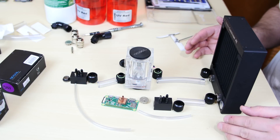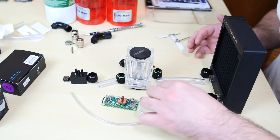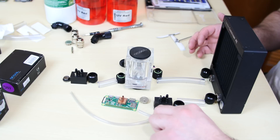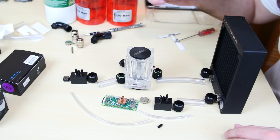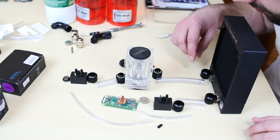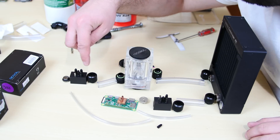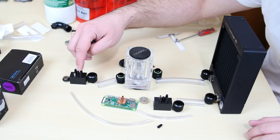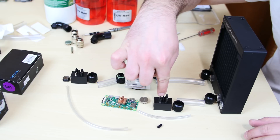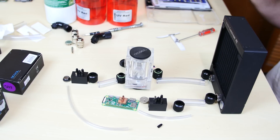I've placed out all the parts exactly the way I want this to run and cut all the tubes to my desired length. I forgot to show you guys one thing — this is a plug that goes on top of this splitter. I already put four of them there; it's a five-way splitter, and this splits the small cable into the big cable. I'll leave a link to this plug in the description. I put all the fittings and plugs where they belong and cut everything to length. Here's how the loop runs: out of the radiator, fitting into big tube, into the res pump combo; from the res pump combo, fitting into the splitter which converts big cable to small cable going into the Raspberry Pi Zero water block; out the other side of the block, back into another splitter converting to big cable, then back into the radiator. That's how the whole loop works.